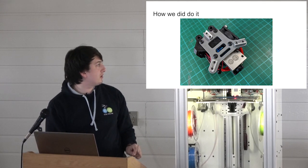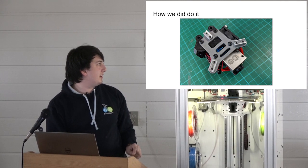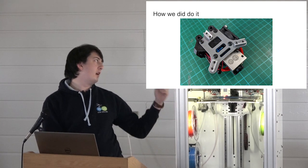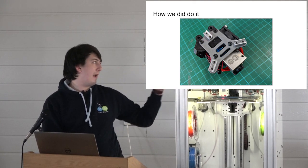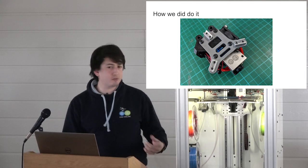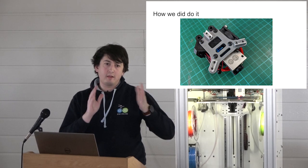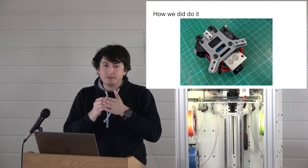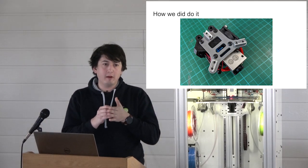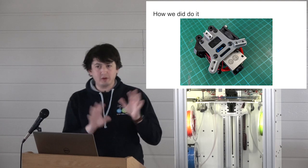So this is just laser cut aluminium. These are machined aluminium at the moment, but we're going to make them out of case hardened ground steel because it's not that much more expensive, and it means that basically aluminium frets, and over time the calibration will move by a few microns, and that wigs me out. So we're doing them in stainless.